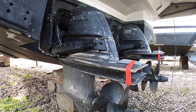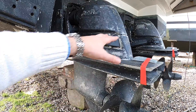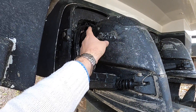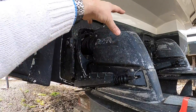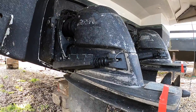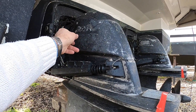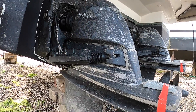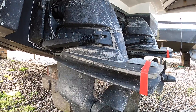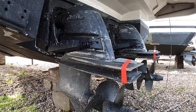What are the downsides? There's a lot going on on the outside of the boat. All of this is aluminium, you've got these rams, the whole thing steers as well. You've got these rubber bellows up here so that as the thing tilts and turns you're keeping the water out. All this stuff needs to be serviced — every other year you've got to have the drives off, change the bellows because they go rigid over time and if they split water gets inside and causes huge amounts of damage. These rams can wear out over time, so there's more maintenance, but it's not horrific.